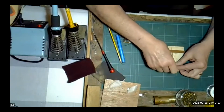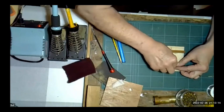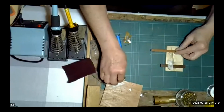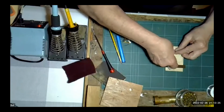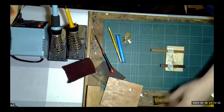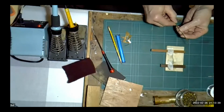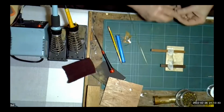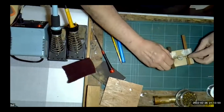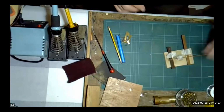To start with, I'd create this little jig by putting on my brass angle, holding that on a little piece of masking tape like so, and the same on this one. These pieces of Paxolin are literally held down with just double-sided tape, but they could equally be glued. You could make up a little jig for your spacing. The brass has been thoroughly cleaned. I did that beforehand. Now, the next thing I would do, I would use this wonderful stuff here, Blu Tack. And this is all actually one by one angle, so I know you were using 1 millimetre and 2 millimetre angle.